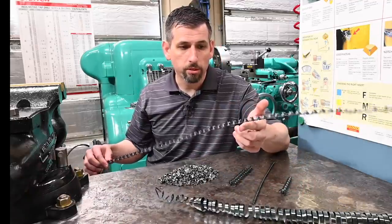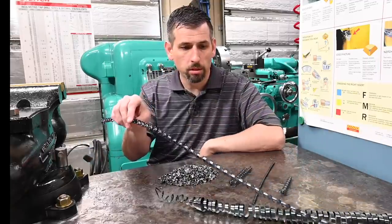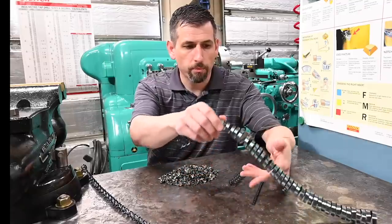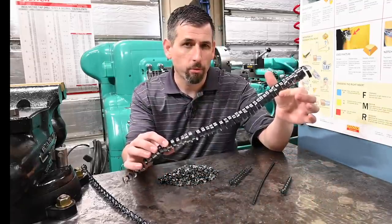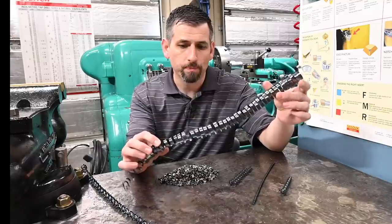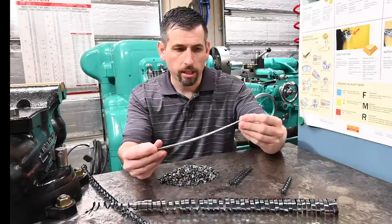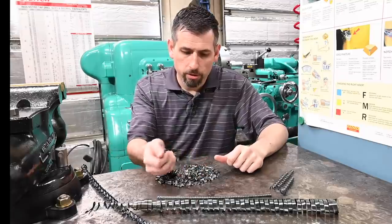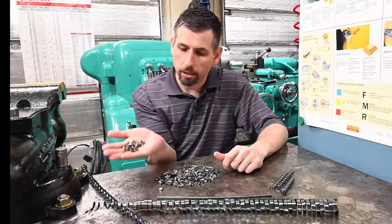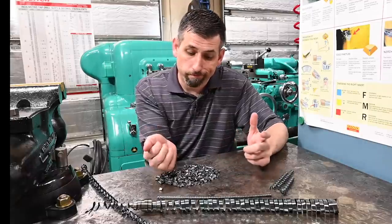This one's interesting to me because it's a heavy cut and it's about 3.5 feet long. This is from the thumbnail of the failure video. So this was, I think, when I very first started taking the heavy cuts, so it would not break there. And we've got a tight little straw here, some curlies. And then when it was finally all figured out, making these big honking 250 thou chips was no big deal.